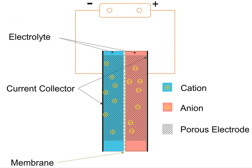As of 2012, a new development used graphene sheets directly as electrodes without collectors for portable applications. In one embodiment, a graphene-based supercapacitor uses curved graphene sheets that do not stack face-to-face, forming mesopores that are accessible to and wettable by ionic electrolytes at voltages up to 4 V. Specific energy of 85.6 Wh/kg (308 kJ/kg) is obtained at room temperature, equaling that of a conventional nickel metal hydride battery, but with 1,000 times greater specific power.